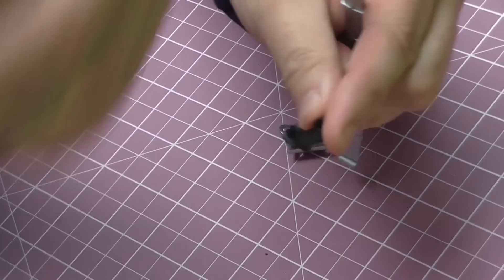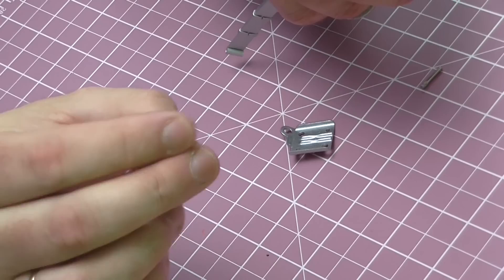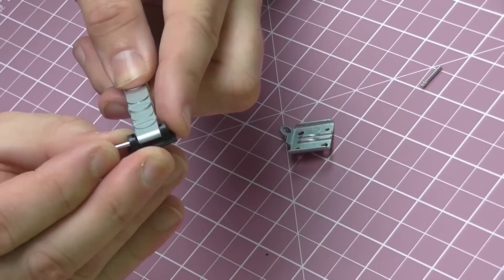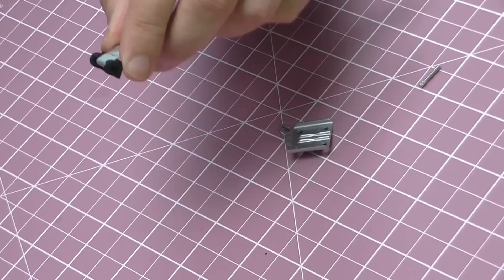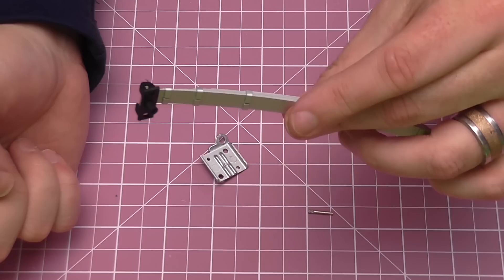You want this detail here — it's very similar to the one we've got but you want this specific one — and this is going to hold in place just on that. To do that we need to put one of the pins through. The pin has a rough side and a smooth side. We're going to drive it in through the point that's got a little notch out of it. Holding it in our hand, offer the leaf spring up, make sure it goes all the way through the hole, then push this into place using the duckbill pliers, and push it all the way through.